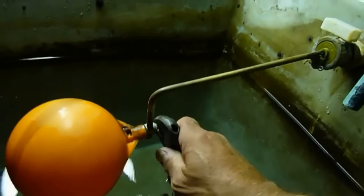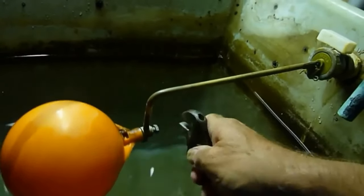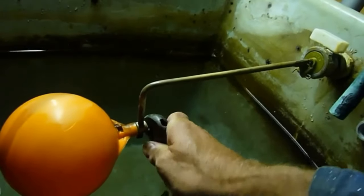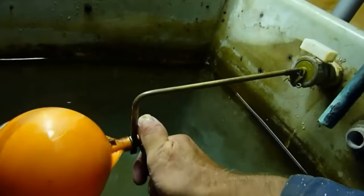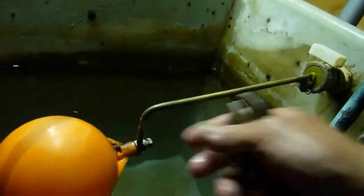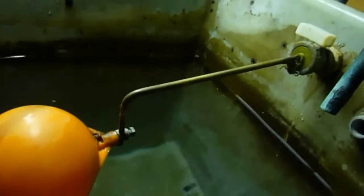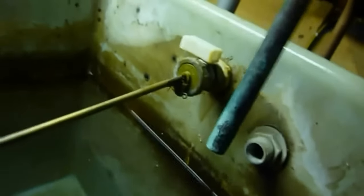You'll also see once you've got that on whether your valve is dead straight — mine's not quite dead straight. Tighten it well up because you don't want the ball moving; if it does you'll get another overflow. When it's sliding up it would pop through. There we are — that is about the job. It's quite level and done. Then we just turn the water on. That's about it — thanks for watching guys, catch you again next time, bye bye.